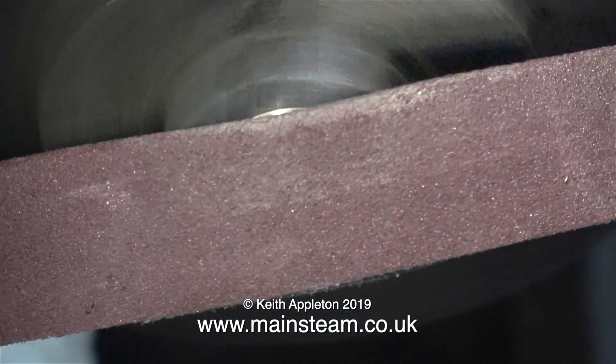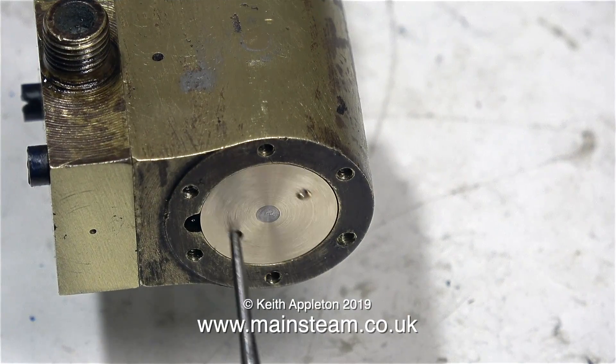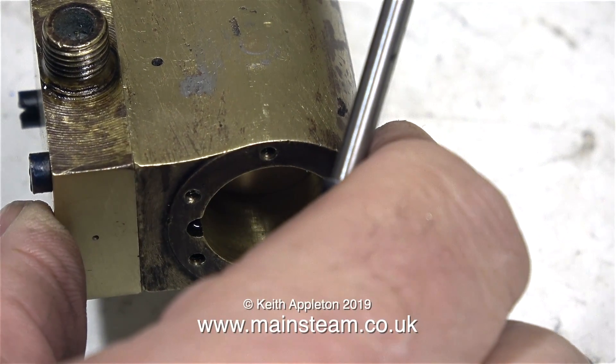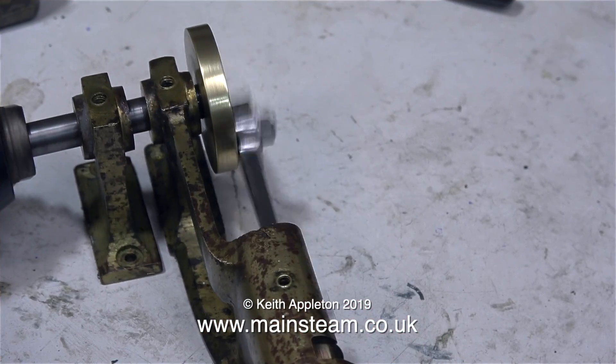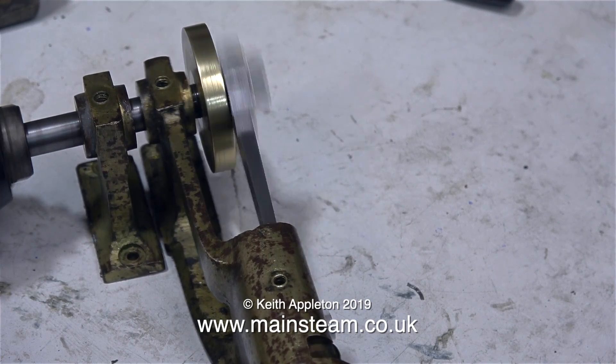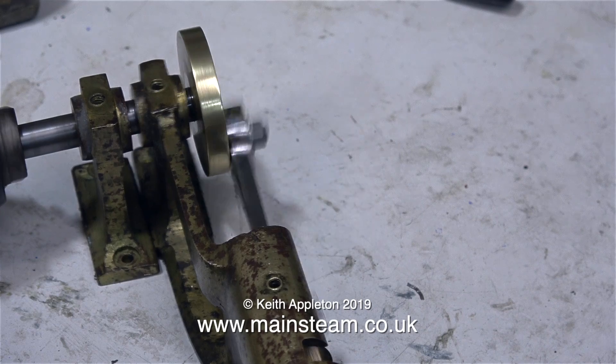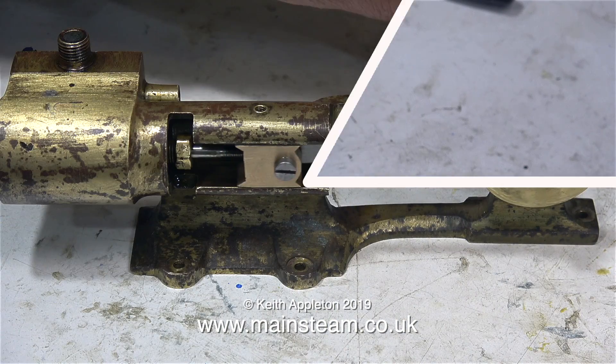Something is not right — the piston should not be this thin — so when I put it into the engine I'm expecting to have plenty of clearance. The piston fits in the cylinder okay, in fact it's a bit too good, so I'm just rotating the part with a bit of oil using my trusty DeWalt drill. And in no time at all everything freed off.